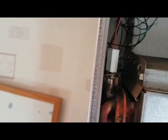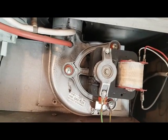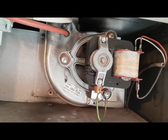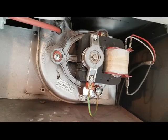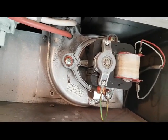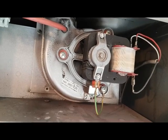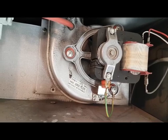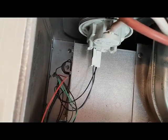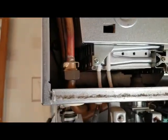Then you've got the calling and the main burner coming on. On the fan unit, you've got a two-speed fan. When it starts up, it'll run on low speed, and then after a minute or so it'll go up to high speed. You've also got the air pressure switch, and as I said, that's the electrodes and the flame sensor — which is at the back and difficult to see.